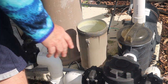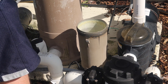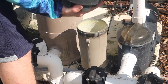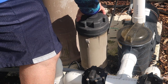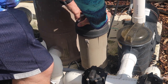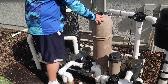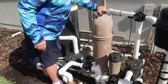Inside there are small pieces of chlorine tablets from last week still there. In summertime I generally put in two a week — open it up, dump it in, open it up, dump it in — then put the lid back on. There's an O-ring inside here that I occasionally lubricate; I've even had to replace that O-ring a couple of times over the years. You tighten it down, and with the chlorine added it will have enough to run for the next week.